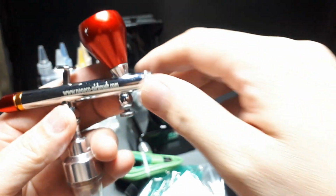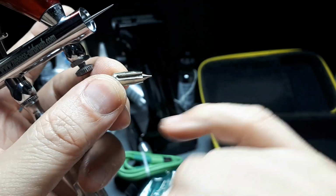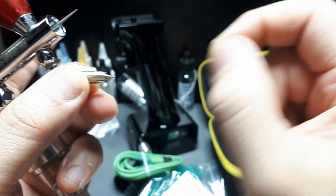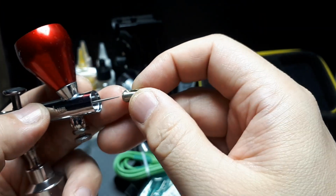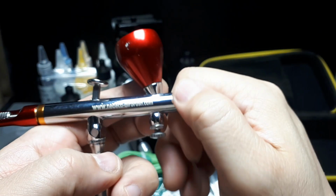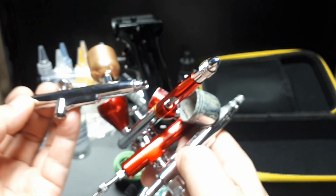And then we have this one, which is supposedly a better design, where it doesn't have that super tiny needle. It has this giant kind of needle. So the air goes through these channels, and then it comes down around this, and then, through capillary action, that high speed of air sucks the paint past the steel needle. So in theory, maybe it'll be easier to clean. I don't know. Again, haven't had it long enough. If you have this one, leave a comment if it's long term, if it's a great thing or not.